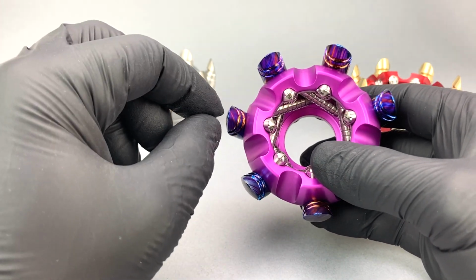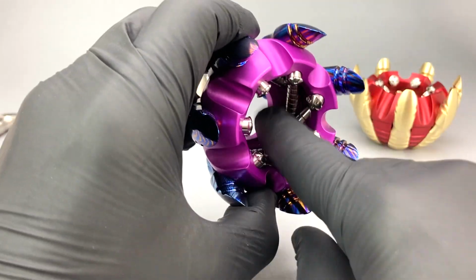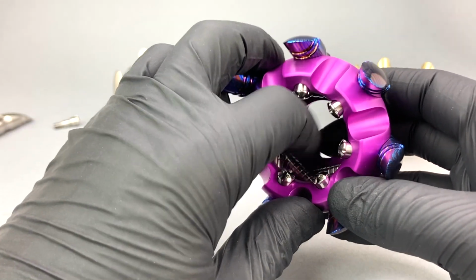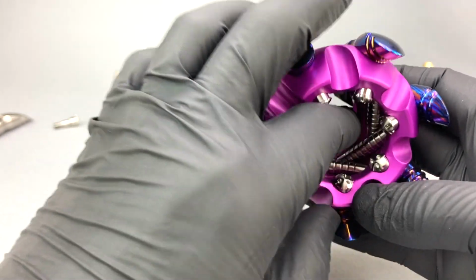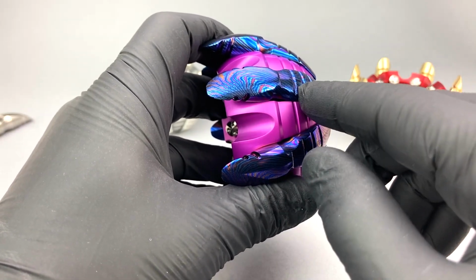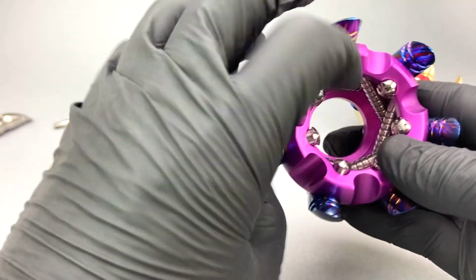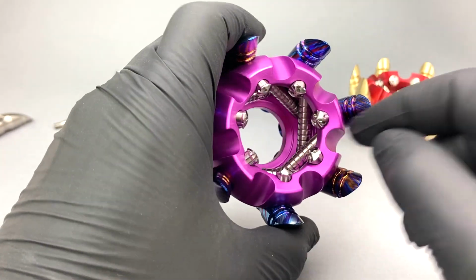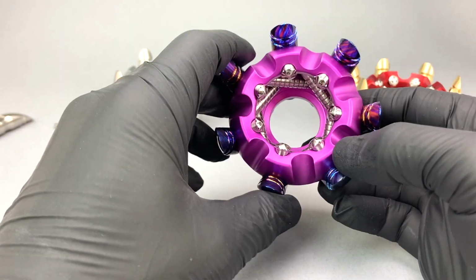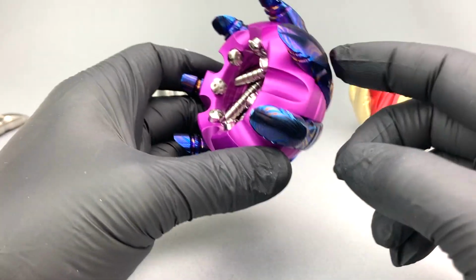The other thing that I didn't do is I didn't make the inner bits out of titanium Damascus, and the reason for that is simple. I want these to roll, and I think they'll pick up small scratches in the process. Probably not much, but since the heat anodizing is only on the surface, over time, if you were to keep rolling that, you would just kind of scratch off that coloring, and I think it would start to look a little nasty. So I decided that these decorative elements should be titanium Damascus, and I should leave these as stainless. Plus, I think this is a brighter coloring and shows off that interior space better than something that would be dark and hard to see.